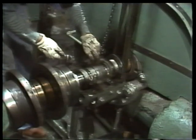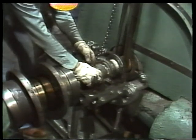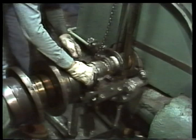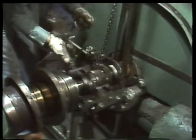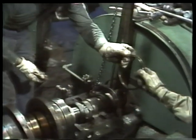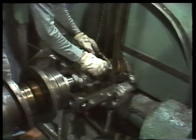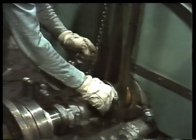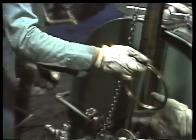Underneath the top shell are the two upper bearing inserts and the oil rings. The inserts have slotted tops to allow the rings to spin freely when the shaft rotates. These oil rings should be handled and inspected with the utmost care — unless they spin freely, the bearing won't get any oil, and even a small burr can make a ring stick. The rings are jointed and hinged to make them easy to remove: position the ring with the joint on top, pull the joint apart, and slide the ring out from around the shaft.